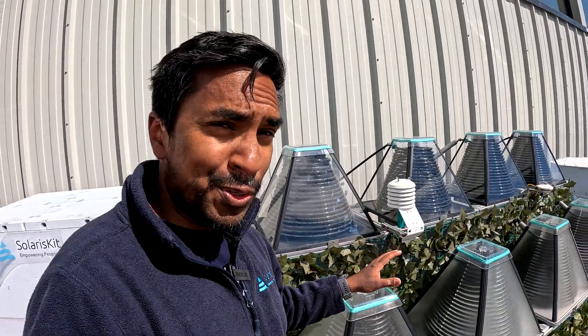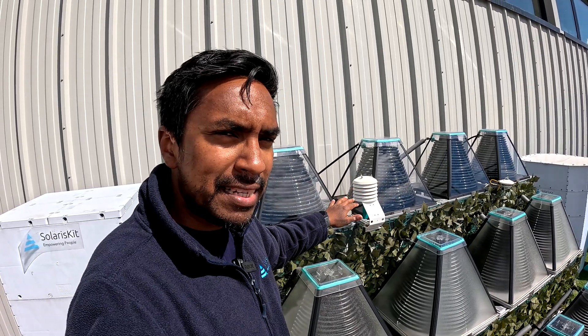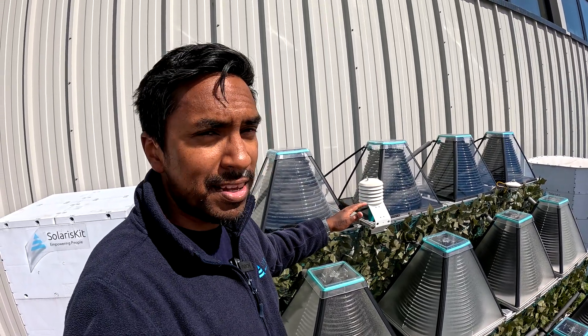What's also quite different about our solution is that because we use these prismatic-shaped solar collectors, you can basically place them anywhere that's sunny — the ground, a rooftop, a gazebo, anywhere within about a 10-meter radius of the hot tub. As long as it's sunny and unshaded, that's the ideal location. With our small 12-volt DC pump we can handle having the collectors a couple of meters high as well — it's a really efficient pump with quite a lot of circulation head, so there are no issues there.